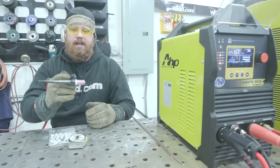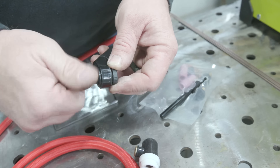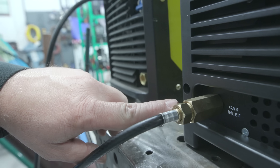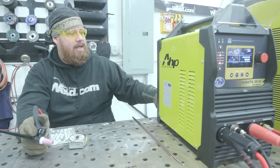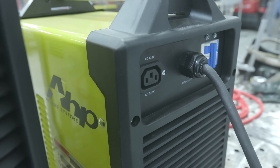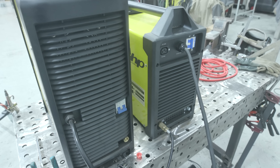Before we get into the welding, a couple things I noticed while setting this up: it comes with the Nova Rotoflex TIG torch and foot pedal. The cool thing is I can swap the head out for a number 17 or a smaller number 9, so I do like that it comes right out of the box with that Rotoflex. Two other key features: the gas inlet has been extended, so you can actually use a separate wrench when putting it in and out of the machine — no more having to break the machine apart to tighten it from the inside. I also noticed the 120 or 240-volt outlet in the back so I can hook a water cooler up right out of the box. That's something the previous versions did not have.